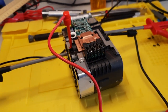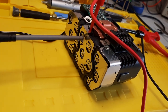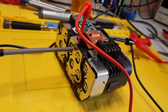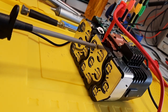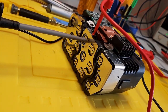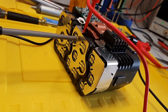From what I've researched and seen other people do, the solution for the smaller batteries like the 4.0s and 5.0s is you can charge individual cells. You can also get a charge balancer and hook up every cell and have it do it for you. But in my case, I don't want to take off those welded tabs and then either get a welder and do a crappy job of it, or solder it and do not as good of a job. So I'm just taking these as sets of three and charging those.